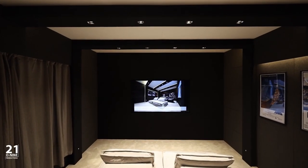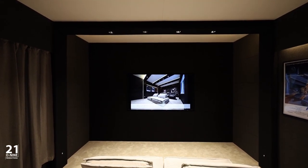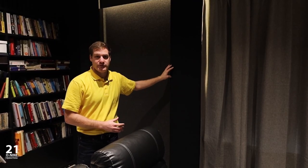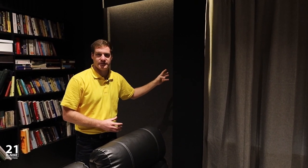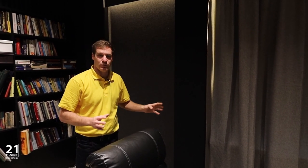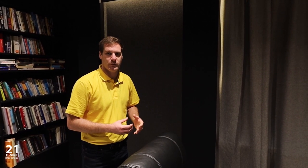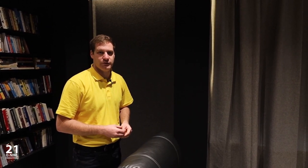All of our wall structures have been fabric wrapped, installed, LED light strips have been installed, and our down lights have been installed. Behind some of these wall constructions are our speakers for our surrounds, our backs, etc. By doing this, we've been able to hide all of the speakers, and that allows us the best flexibility for changing the configuration around, whether it be a simple 5.1 system all the way up to a 9.1.8 speaker configuration.